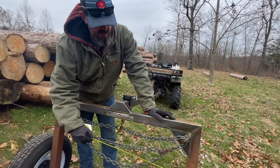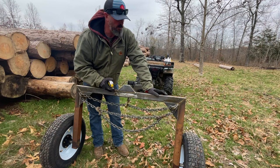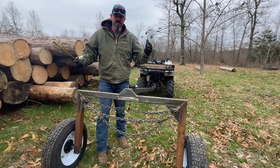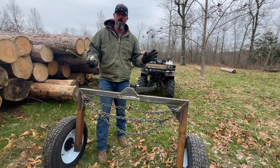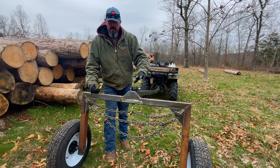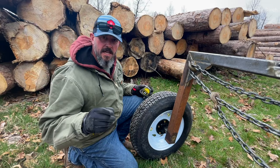We got 48 inches in width. Our legs overall ended up being 27 and a half inches. I changed these to eighth inch tubes — didn't see the need for them to be heavier being so short. You guys can make it out of eighth inch, 3/16, or quarter inch if you want to go real heavy. If you want to put bigger logs under this, add yourself six, eight inches, or a foot — whatever fits the logs you're mostly hauling. Everything will be in the description along with all the links to the stuff we used on this build, except for the trolley — that was just pieces and parts from our local trailer supply house.